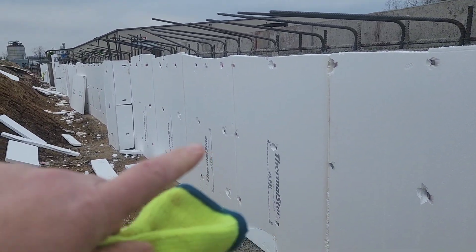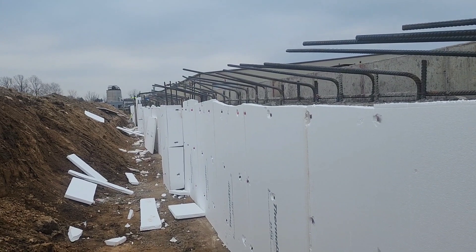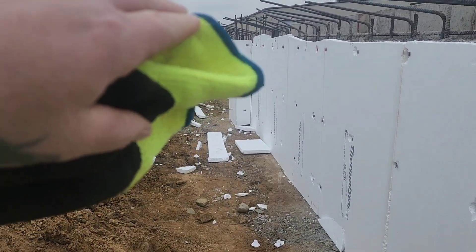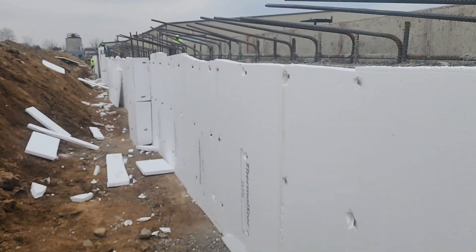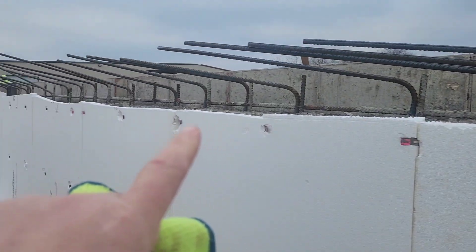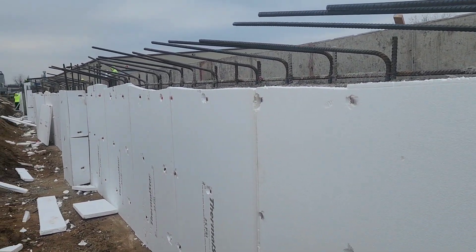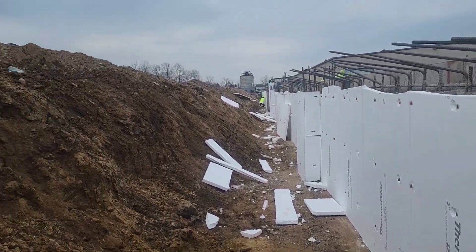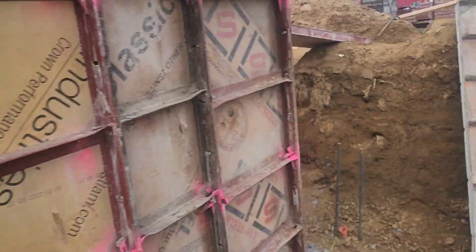Alright, wallboard got the back side stripped. We're putting on our styrofoam here, got all our slab dowels in. Essentially this will all get filled in right here, up that, and then there will be a floor that comes over — the floor is set right on top of that. This area here down to there is a loading dock area, so it's going to be down another foot below finish floor. We are making progress.